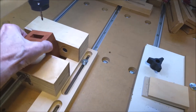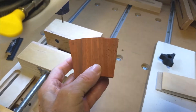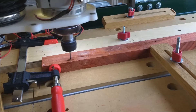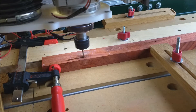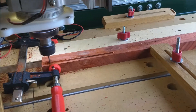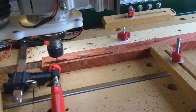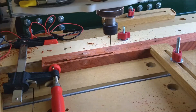There's another video on my channel showing the making of this bench vise. Now we'll show the milling of mortises in one of the main stiles of the stand project. The main stiles are 64 inches long and the cross section is 1¾ inches by 0.95 inches. This particular set of mortises is at the bottom of one of the stiles, showing a mortise for the lowest rail, a slot for the panel, and the mortise for the upper stile in the lower set of panels.